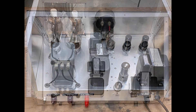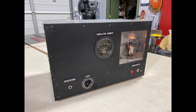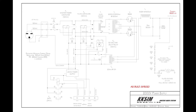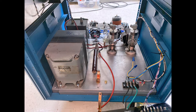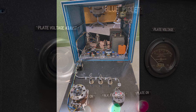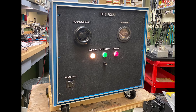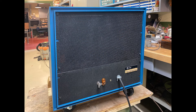I followed the same construction procedure for the modulator as I did with the PA. To power this puppy, I designed — yes, all by myself — a simple 2 kilovolt power supply using a plate transformer gifted to me by John Milner, K4VZS. The rectifiers are 3B28s. The 240 volt primary of the plate transformer is wired through a variac to vary the plate voltage output. I had the blue enclosure in inventory and named it the Blue Piglet. Old pal Butch Charteau, K0BS, once built a 5 kilovolt version he named the Blue Pig. Butch uses it for his QRP work.